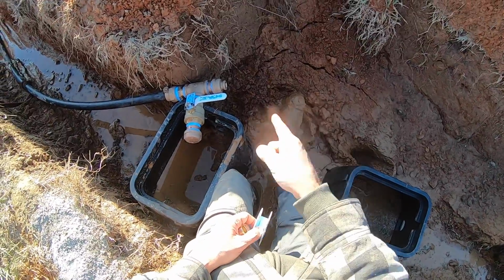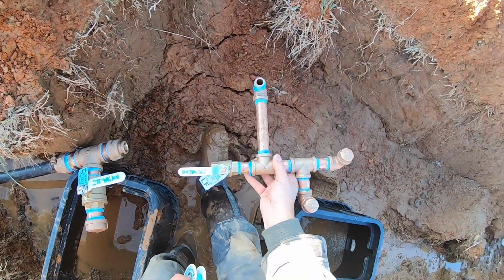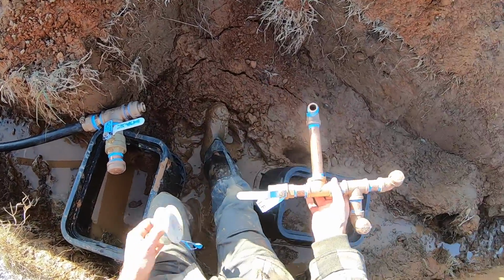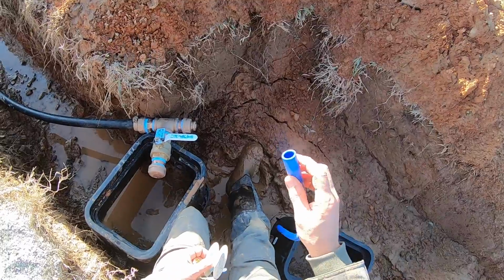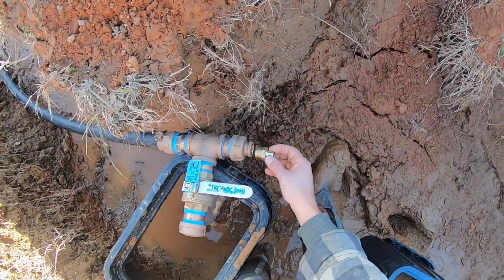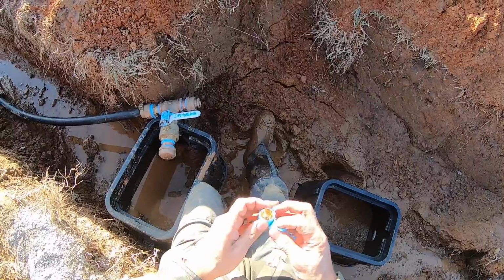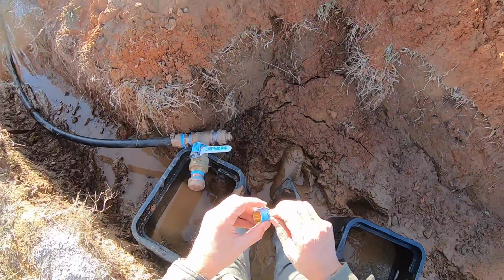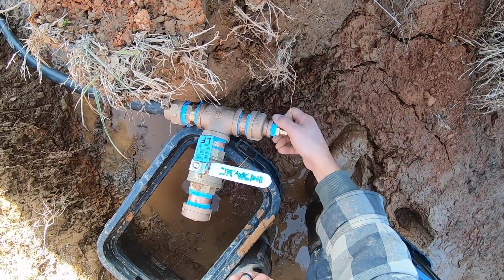All right, since I originally had a brass nipple connecting the next section of fittings here for the hydrant and the sink and irrigation system, but that was going to be too close together to go from box to box, so I decided to switch that up to some PEX, some CTS copper tube sizing PEX. It's for underground water systems here. So that means I need to put in the male PEX fitting there. And because I'm doing this PEX underground with ring clamps, whatever they're called, I'm also going to wrap it in a silicone tape just to be safe, so it lasts.